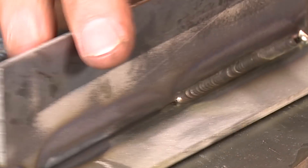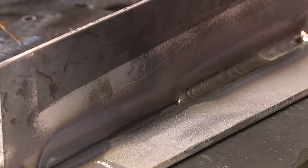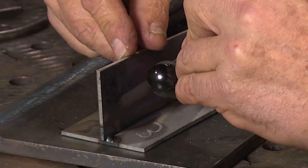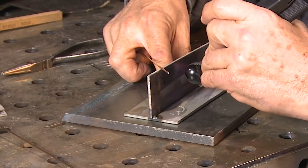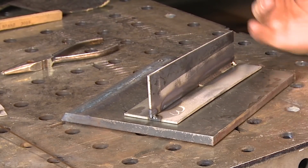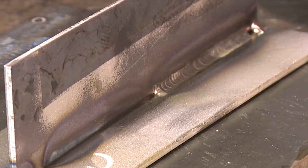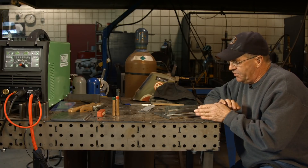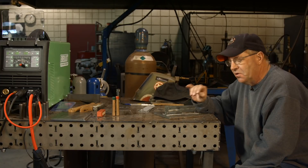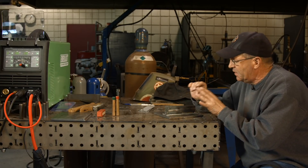The second part was basically the same, with the exception that I increased my tungsten stick-out a little bit — I have a number six cup, by the way. So I had more of a torch angle, and just by moving it back and forth the torch traveled on its own. I kept the wire on the leading edge of the weld pool to create pretty much the same thing. These types of welds tend to cup a little bit more and have a concavity to them versus one that you would dab. For those of you starting out, there are a couple of options right there. If you want to build the weld up, introduce the wire on the leading edge and push a little bit — push it in a sixteenth and you'll see it crown up, your edges move forward. Repeat that. It's like stacking dimes.